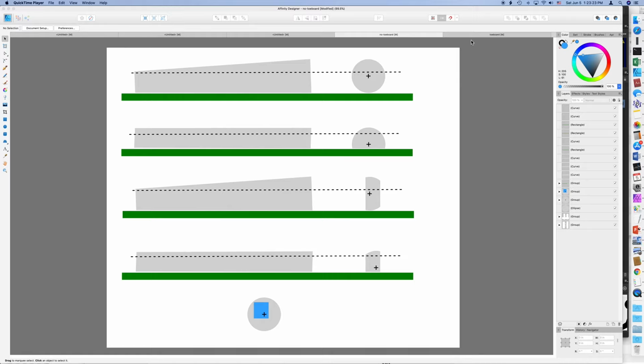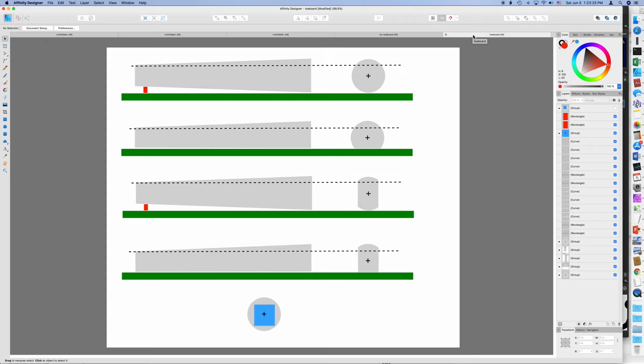Now I want to switch over to the same process with a toe board. And it's really the same four steps, but you can see I've got a toe board over here. I'm going to use that toe board on the very first cut to jack up this end of the log so that the grain and the center of that log is now parallel to my sawmill bed. And so we'll make that first cut shown here.